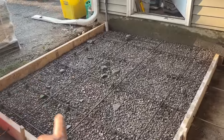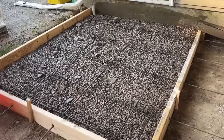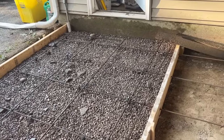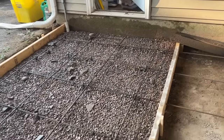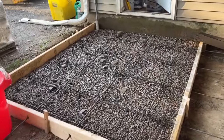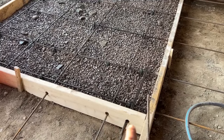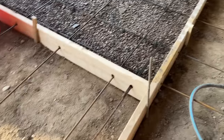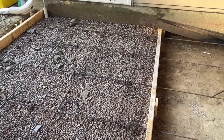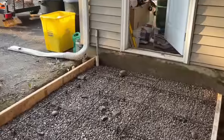This is ready for concrete — I didn't think it'd take me this long; it's already around six o'clock and I still need to start dinner. The rebar is 18 on center, just like the initial slab over there, except for one corner that was far from the edge where I needed to add an entire extra piece of number three rebar. I still had some extra rebar on hand for that.